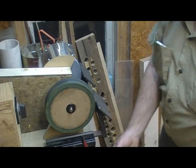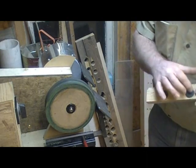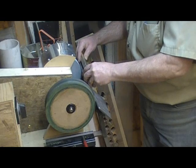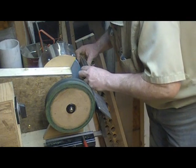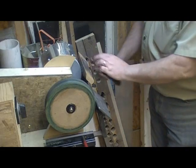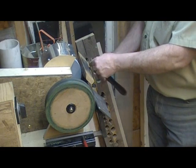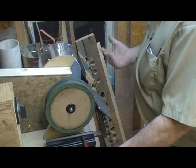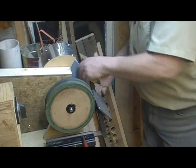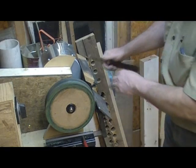So I made this wood block with a couple of one-inch rare-earth magnets and high-friction pads mounted on them. Magnets and grinding don't really go together all that well, but you've got to do what you've got to do. That gives me a narrower rest so I can get more tool overhang with the handle still swung over that far. Because I've raised it three-quarters of an inch, I now have to readjust the tilt of the table to get my bevel angle again.